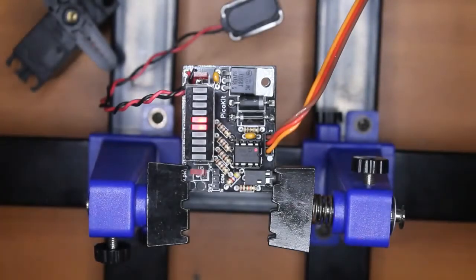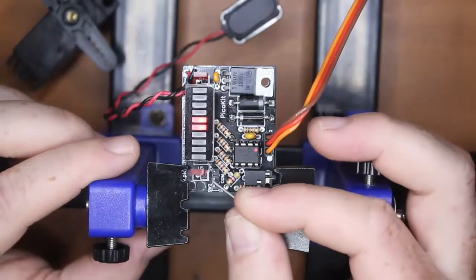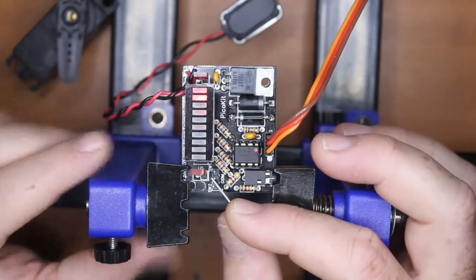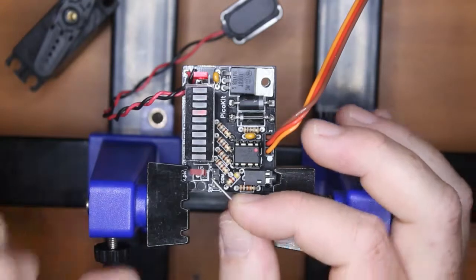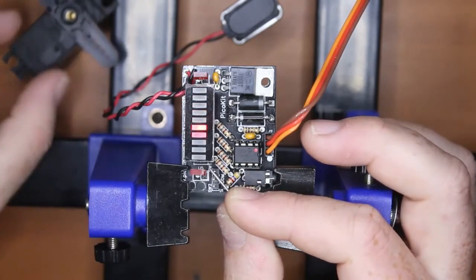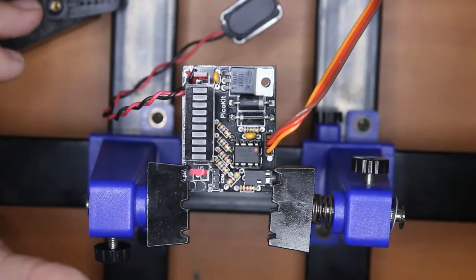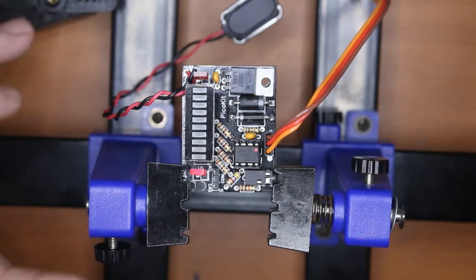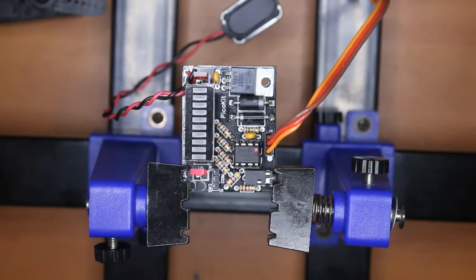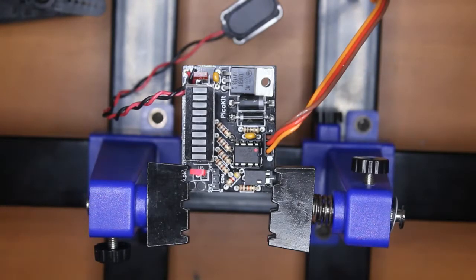That's good. Now to test it out, you just need an offcut of a wire, and we're going to short out pins 1 and 2 on there, and you'll see it go up, and you'll see the servo turning. And if we short out the next 2 pins, you'll see it coming back again, and the servo is turning the other way. Now that's set at 120 degrees there, particularly for planes that need trim flap controllers. But if you need some help changing that to a different angle, minimum and maximum, then contact me at picokit.com.